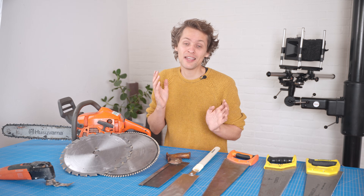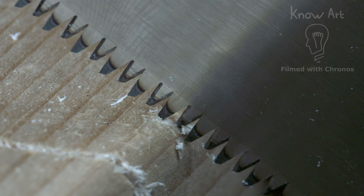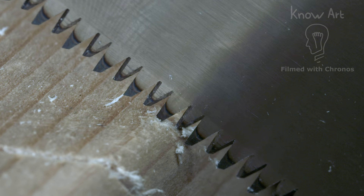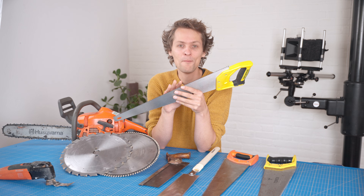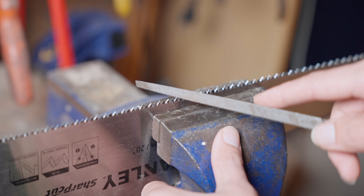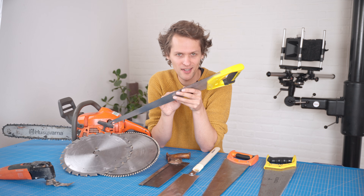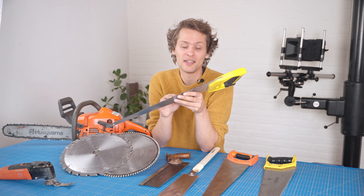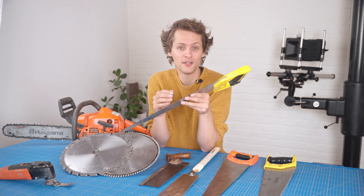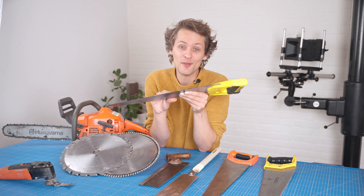This obviously needs very hard teeth. Sometimes you have a tiny superfine wood saw, and someone thinks that's a metal saw, and then a kitten dies somewhere. Many modern hand saws have hardened teeth — I don't recommend using them for metal, but they don't get dull as quickly after you buy them. However, if you try to sharpen them, you ruin your files, so it's generally not recommended. You could argue that this is something saw manufacturers do to sell more saws, but I think they just know you are not going to sharpen them anyway.